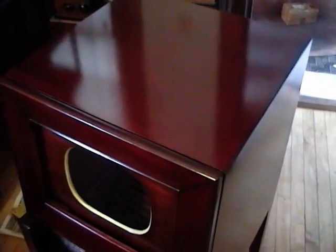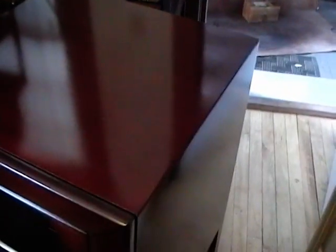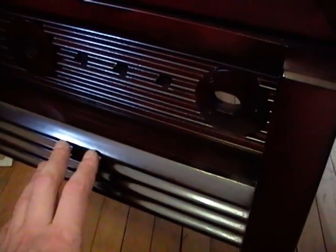Hey guys, time for an update on this Philco 491040 cabinet, I think. Okay, so I finished off the main body of the cabinet. I finally finished touching up the control area. I slowly filled in all the nicks and dings with both clear and tone lacquer depending on the damage. Clear coated, sanded, more clear coats, with a final coating of semi-gloss Deft lacquer.